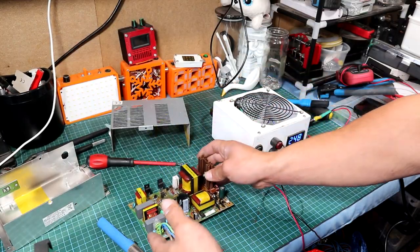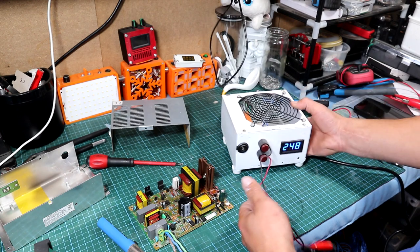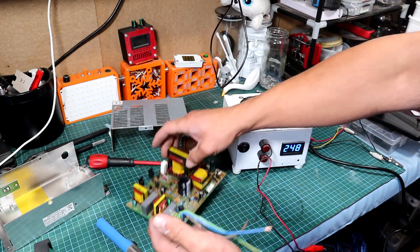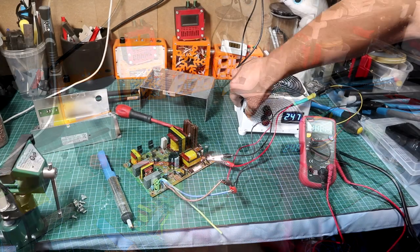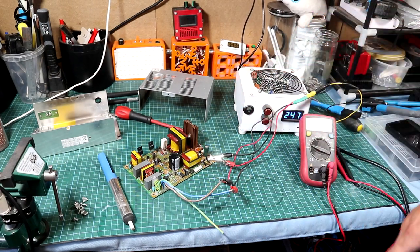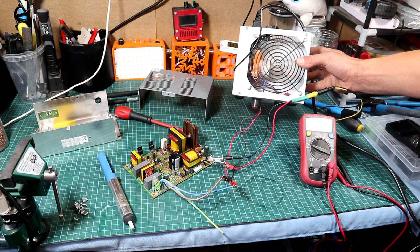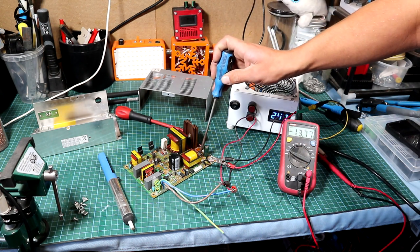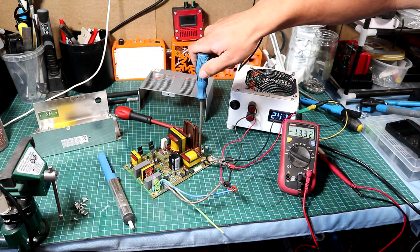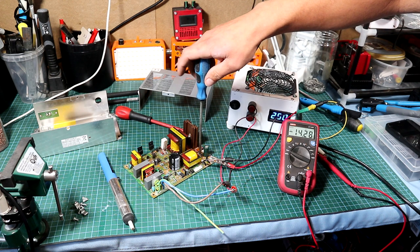Before trying to power the board we need something like this - it's an old device I built, basically just a bulb connected in series with any PSU or transformer for troubleshooting. Let's connect the PSU up and bring a multimeter into the mix to see the output voltage. After powering it, the bulb flashed once and is now staying a bit lit, meaning power is going to the SMPS unit and passing through the bulb. We have a voltage of 13.8 volts right on the spot. Using a small trim pot on the board it can be adjusted from a minimum of 12.8 to a maximum of 14.28 volts. We've just fixed it - great news.